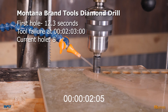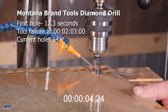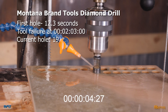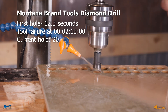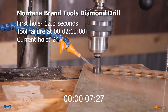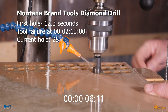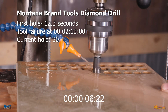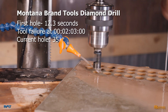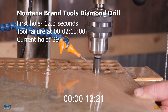Compared to the competition, the Montana Brand tools performed exceptionally well. Unlike drills that are made in other countries, this is designed, made, and built in the USA — manufactured from start to completion. The diamonds themselves are a higher grade than the others, so they don't wear as flat as quickly. When they fracture, they leave sharp edges exposed, and that's why even when we had a test showing down to 17 or 20 seconds, once a few edges fracture and expose again, we're back to cutting at 14 seconds.